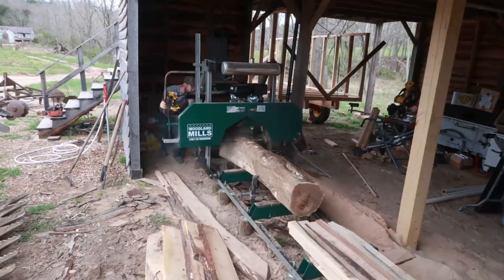And I may have already covered this, but the floor of the coop is going to be sort of a slat floor, to where I'll cut out a bunch of strips that are maybe 1 by 2 inch, and then I'll put maybe a 1/2 inch gap in between each one of the rows. That way there's gaps in between the slats that some of the manure can fall through.